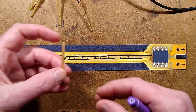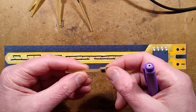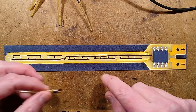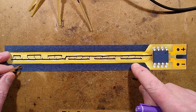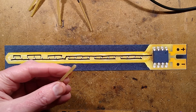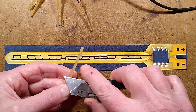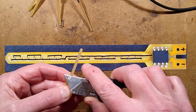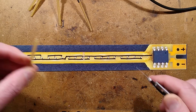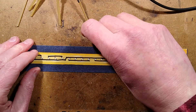The microcontroller — worth noting — is something you could theoretically remove and replace with your own code if you wanted. It's interesting to note that the LEDs are flip-chip LEDs, and they've put gel phosphor on both sides, even though it's not actually needed on the back side of this particular one. An attempt to gouge the clear gel off one side didn't work — an impromptu thing that went wrong.